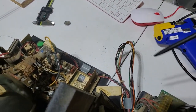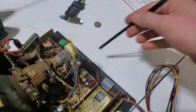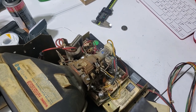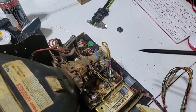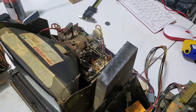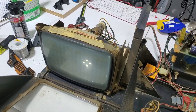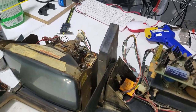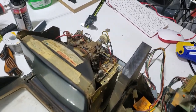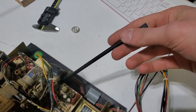There's no power supply on the chassis - it's a little tiny chassis. You get 12 volts here and 12 kilovolts there, which I tested with a high-voltage probe. So I had all the voltages and I saw the filament glowing, so I knew it should have been working most of the way. I was looking at it really closely and I could barely see a faint image on the screen. I looked up the schematic for this so I can figure out what the pots are, since some of them weren't labeled.